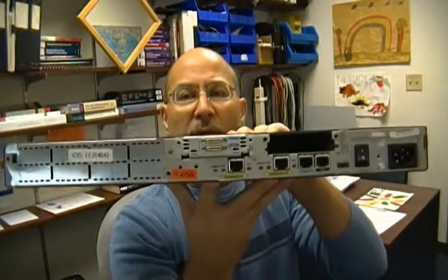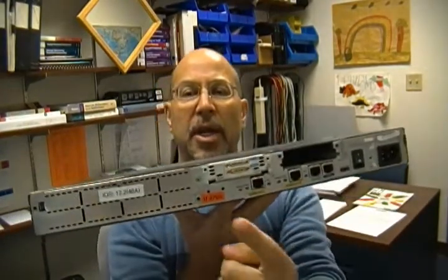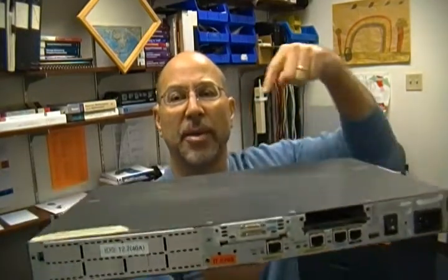If you're connecting a COM port on a PC to a console port on a router or switch and you're running those wires yourself, usually you're okay. The problem lies when we're dealing with patch panels — sometimes we wire all of those connections to a patch panel so that we don't have to find the jacks, especially when the console connections aren't all up front and are on the back side. So a lot of times we run those to a patch panel and use the same sort of patch cable from a console connection to another console connection. You've got to think about what you're doing and what they're labeling. Remember that even though sometimes the ports look the same, they are not the same thing. The two standards are completely different.